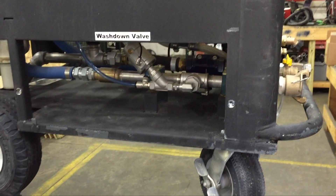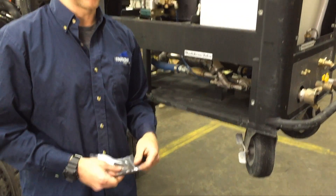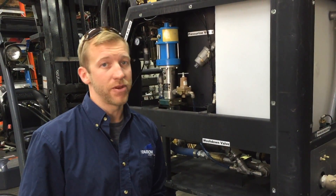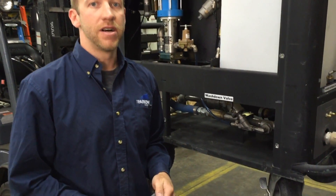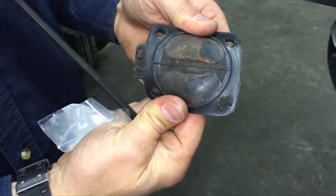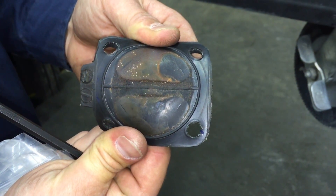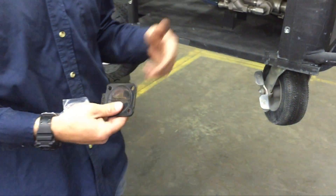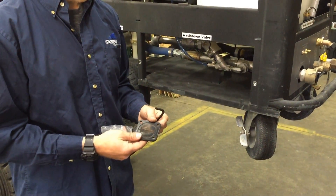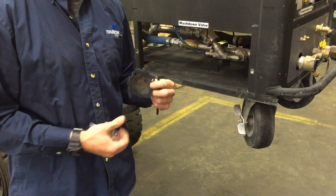You'll have different wear times on your diaphragm depending on the materials used. If you're using garnet opposed to recycled glass or coal slag, those heavier, more coarse materials will wear it out quicker. If you can avoid using them, it would be a lot healthier for the machine. If you're painting, you don't need that coarse material — it will groove your surface and use more paint. Make sure you plug all your lines back in and be aware of the effects of different materials.